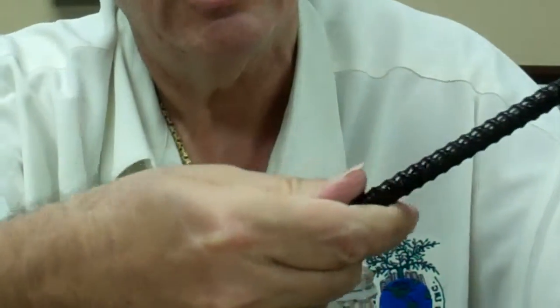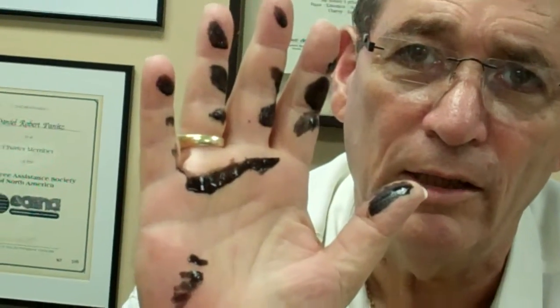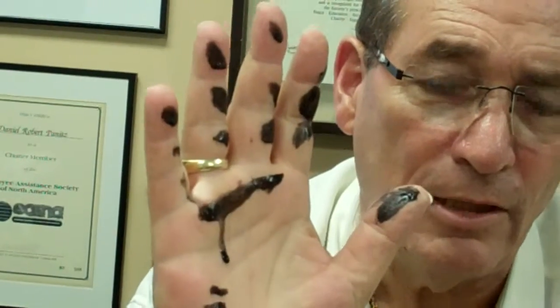I want to take this out of the water so you can see it. I'm going to place my hand across it. This is active oxidation going on, because there's a flow of electrons that the salt water is encouraging. In the case of GeoBlue II, it retards the flow of electrons — it acts like an insulator. And if you retard the flow of electrons, you stop or retard the oxidation. In addition to that, cement itself begins to get acidic, and as it becomes more and more acidic as it ages, it again encourages or exacerbates oxidation.